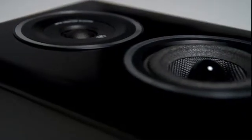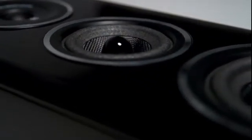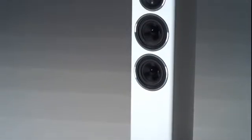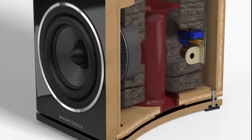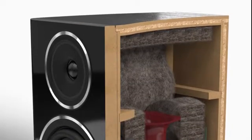If you think about the engine in a sports car, it's of no use without the aerodynamic bodywork and the supple suspension. And similarly with the drive units and the loudspeaker, they need to be fitted to a low resonance cabinet and a highly refined crossover to do their work. The cabinets of each Diamond 11 series speaker are expertly engineered to make the most of the advanced drive units. We've created a multi-layer sandwich of woods of differing density to subdue the identifiable characteristics of the cabinet's sound, and so let the drive units speak for themselves. In addition, the cabinet walls are lined with a specially developed internal fibre, chosen because of its outstanding absorbent qualities across a wide bandwidth.